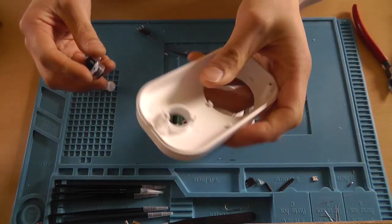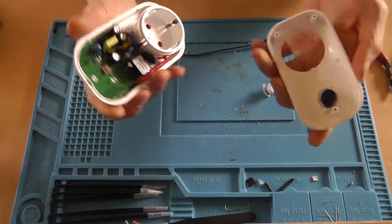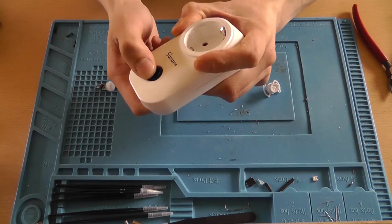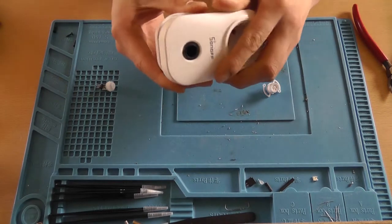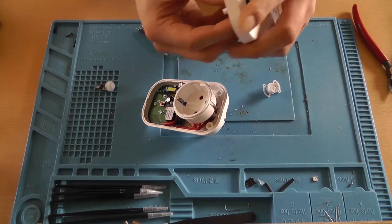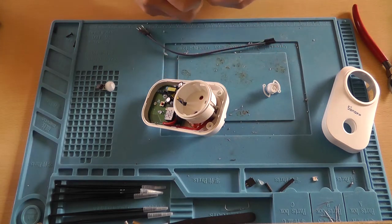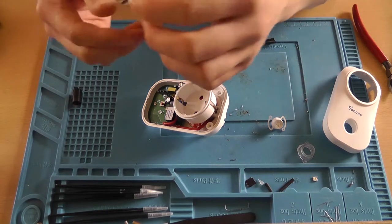Now what you want to do next is grab the front plate, insert it into the hole, grab the back side and put it in place like this, and make sure that you can press the button, make sure that you can hear the click, and if you do, that's alright. Now you know that everything is working with the movement. Now you can remove the 3D printed part again from the clear part like that and grab your PIR.